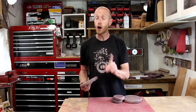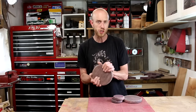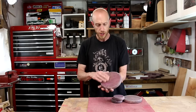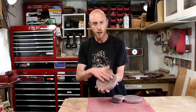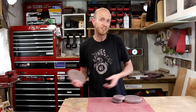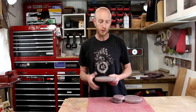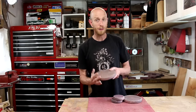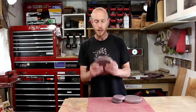Now I have these pieces all sanded down to 220. One thing about Purple Heart — when you machine it and sand it, it kind of loses that purple look. You can see on this side it's a little more purple, but on this side it's more of a reddish brown. One way to get that back is to really just give it some time. I'm going to put these outside for a few hours and most of the color should return — at most I may have to wait overnight for it to gain that color back before I put a clear on it.